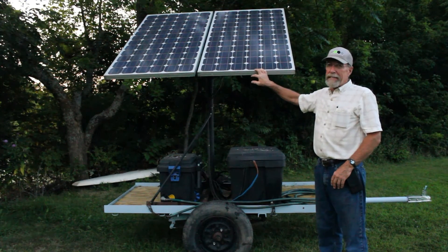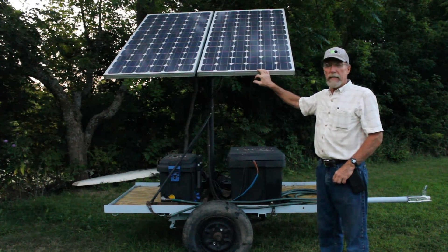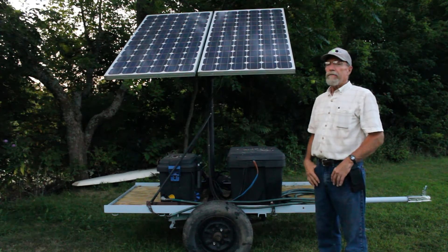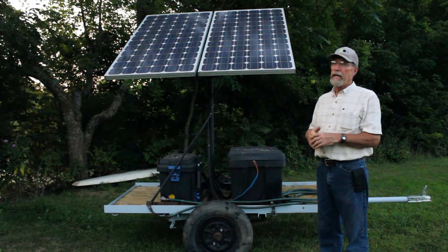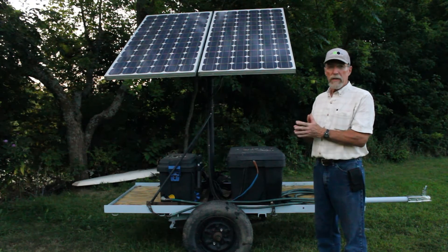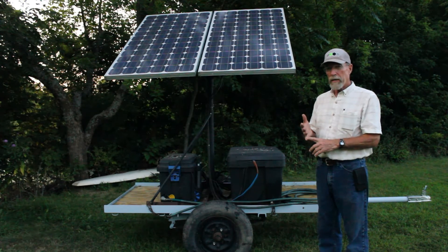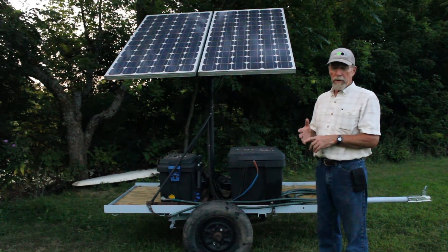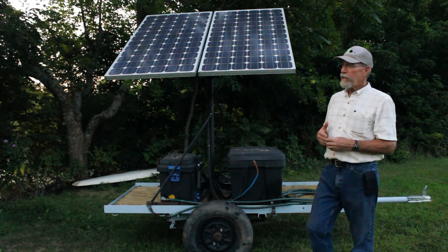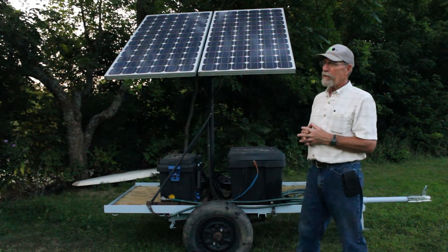We have been using this solar pumping unit for about 10 years and it has worked very, very well. The only problem we've had is one time lightning struck and apparently burned out one of the controllers — when we replaced it, everything worked fine again. If you're thinking about a solar pumping unit and you don't know a lot about electronics, you need to get with a good dealer who can work with you to understand what kind of livestock you're hoping to water, how many, what part of the country you're in relative to how much sun you get, and how high you're going to lift the water. Once you get it going, you'll likely wish you'd built it a little bigger, so you might want to oversize it just a little bit.